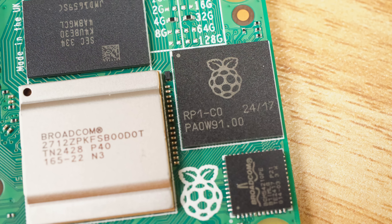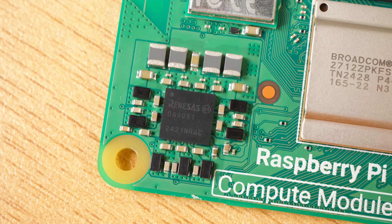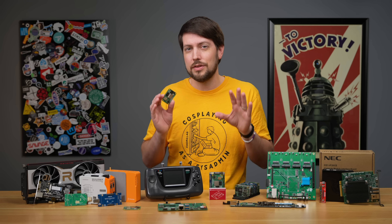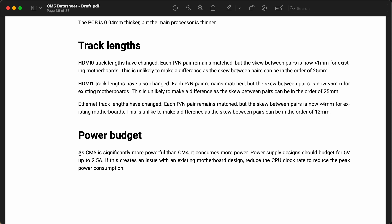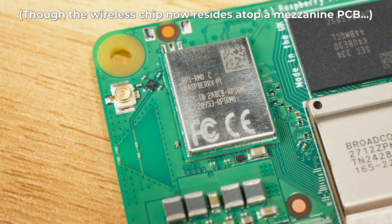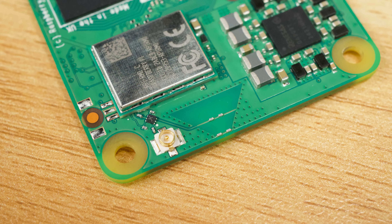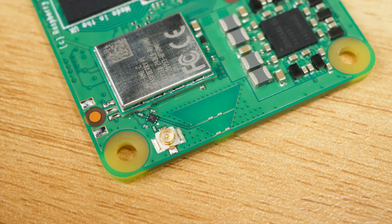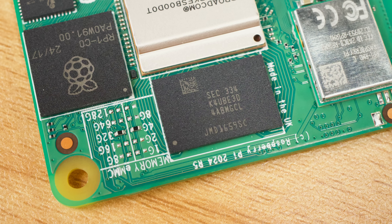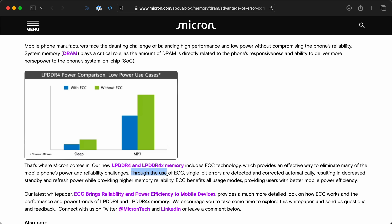The RP1 is the little PCI Express chip that's on the Pi 5, handling most of the IO like GPIO, USB, camera, display, and Ethernet. Down in the bottom left there's a new power circuit — the exact same one from the Pi 5 — so the CM5 can handle USB-C power delivery straight into the board. For full power you can supply up to 5 amps like on the Pi 5, but it'll run on less if you underclock the SoC a little. Finally, there's the same Wi-Fi and Bluetooth chip on wireless models with selectable antennas. The PCB antenna actually performed better in my testing than cheaper external antennas, but it won't work inside a case, which is why there's an external antenna jack. There's also an LPDDR4X RAM chip — technically ECC, but not the same kind you'd find in a server; it just corrects for bit flips on the chip and doesn't report back to the OS.